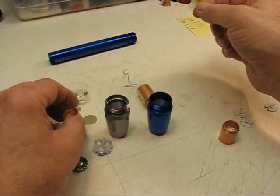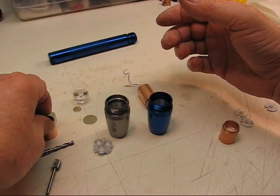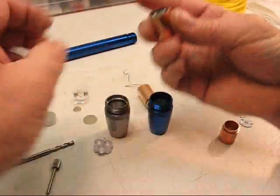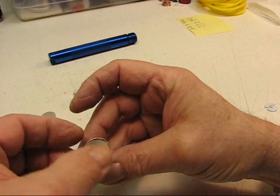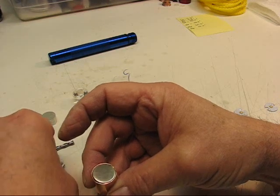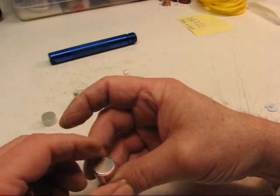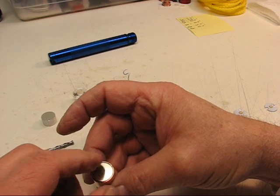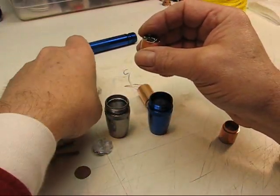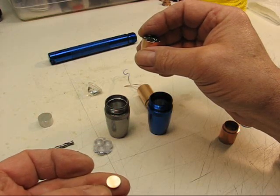That's the basics of it. The other thing I'm doing is, like with these 2.8 amp drivers, they're double-sided, so I have to do something for a bottom plate. I'll be using these rounds, but they're nickel-silver — I'm doing away with the copper because there's been too many problems with it. I'll be boring out the center of that round for the positive spring to come through, and then that round will be what the body touches against to make contact. I may even use a very small 3/8" nickel-silver round on top of the spring for positive contact.